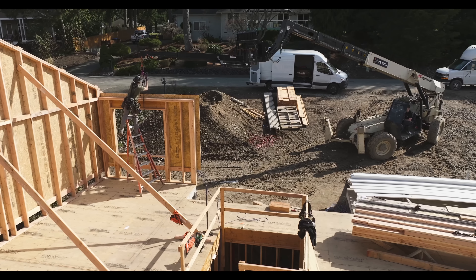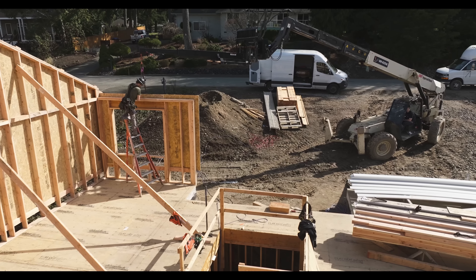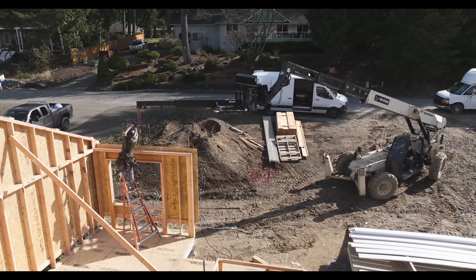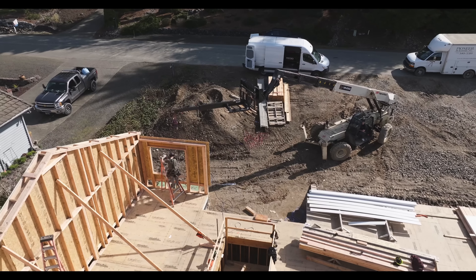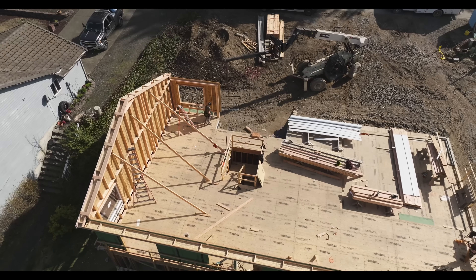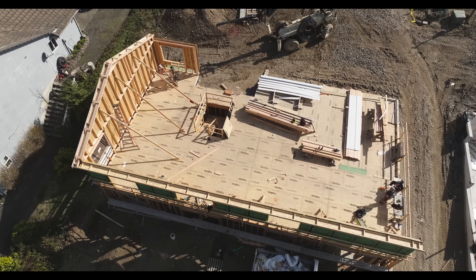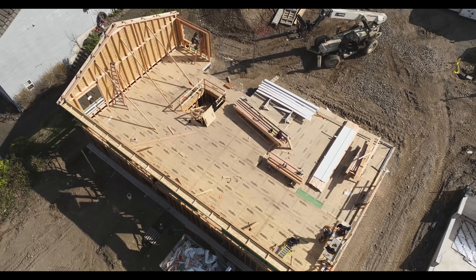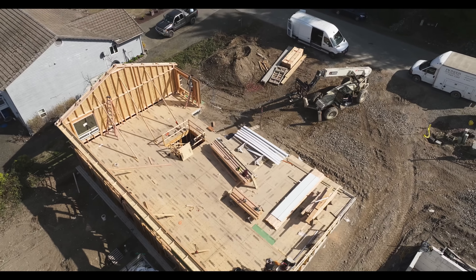There's a better look at the truss jib and how the wall fits in. We'll get more insulation in at the header. The four-by-six blocking along the left — the top of that blocking is the top of the standard height wall. This allows fire stop, it allows connection for our shear panels, and it helps to keep the wall stiff as it goes up. You've noticed some shiners there — the nail that missed the stud. We did that on purpose so that everybody knows what style of nail we used, the right length, the right thickness. That's what I told our engineer on a site visit — he said it seems like you miss a lot of nails, and I said, Terry, how else would you know what size nail we used? Almost sounds plausible.